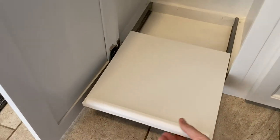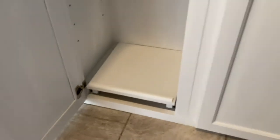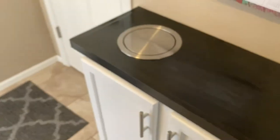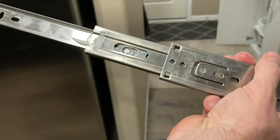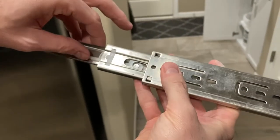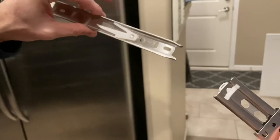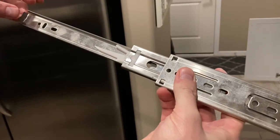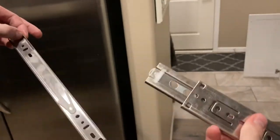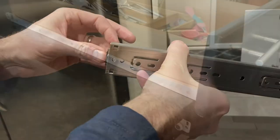Let me show you around. It's just a shelf made out of wood with glides installed — I'll get to that in a minute — and everything slides out beautifully, silent and quiet. These are drawer slides; I happen to pick stainless steel ones and I'll pop a link in the description below. They come in various lengths — this one is a 10-inch. The part on the left attaches to the drawer or shelf you're installing, and the two parts on the right install in a stationary position inside your cabinet.